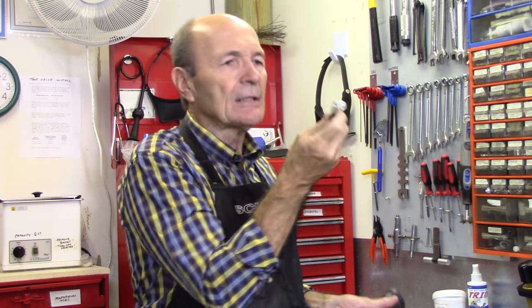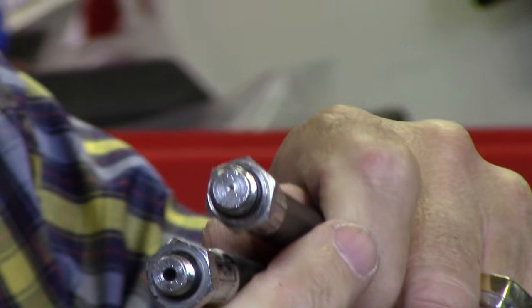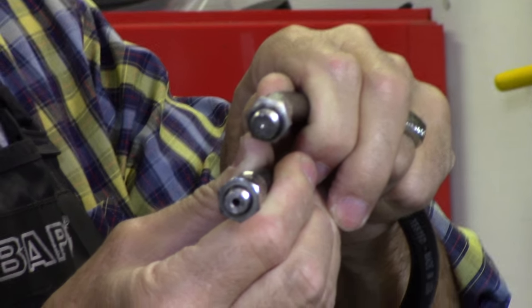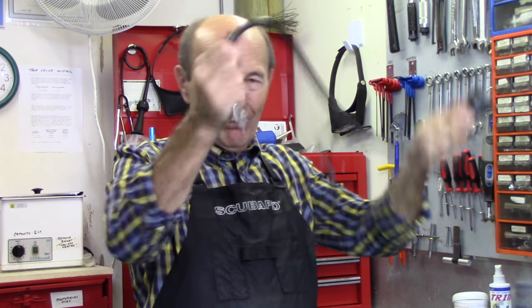And look at the end. Can you see the end of this hose, Kevin? This is an old high-pressure hose, okay? Now, look at the end of a modern high-pressure hose on top. Can you see the difference? Sure enough, on an old regulator, the high-pressure air came out of the regulator into this hose, a large opening, down to the pressure gauge. And on this particular gauge, if this hose broke, which wasn't uncommon, then as I described, this hose would whip around and it could really hurt somebody. A lot of air came out, okay?